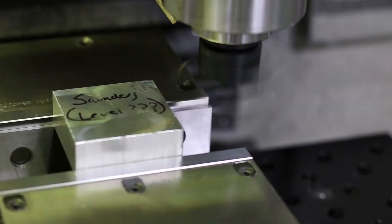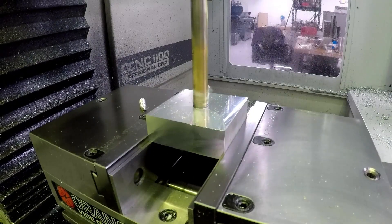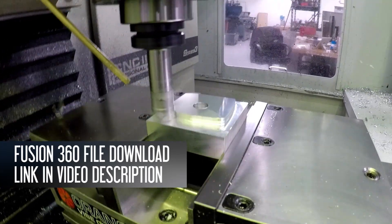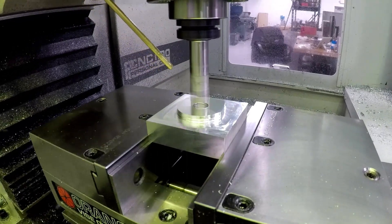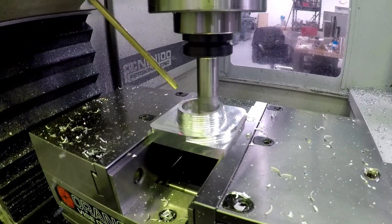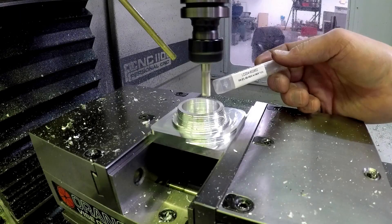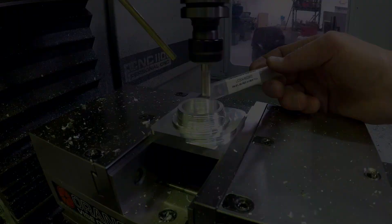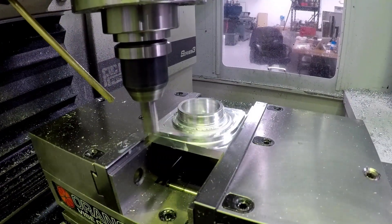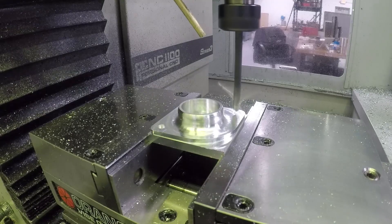Here we come with a superfly — we've actually learned we can go way faster; we're going about 50 inches a minute here, 2,500 RPMs. Half-inch twist drill: my go-to recipe has always been 1,175 RPMs, 5.5 inches a minute. Sheer hog: 4,000 RPMs, 10 thou per tooth, which is 40 inches a minute — works great, really does. More details you can find in the Fusion 360 file, which we offer for page folks supporting the channel on Patreon. This is now a bullnose end mill — it's a 3/8-inch end mill which instead of having a square corner or being a ball end mill, just has a big radius. In this case it's about 60 thousandths of an inch, but they're great for this type of finishing or surfacing work because with a ball end mill you lose surface footage right at the center, so I don't want to cut with that center.